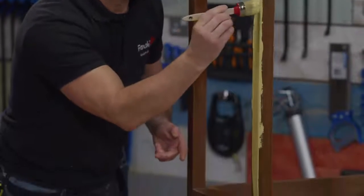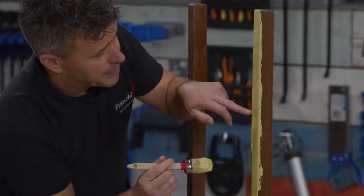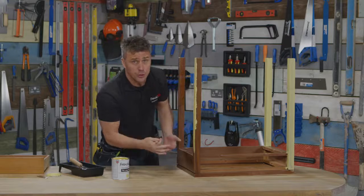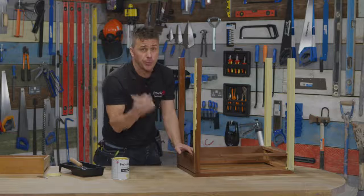You don't start painting the legs from left to right, because as you do that — you can probably see on that side — the excess paint catches the lip on the corner and will drip down. You'll find yourself keep going around and around and it will become unenjoyable.